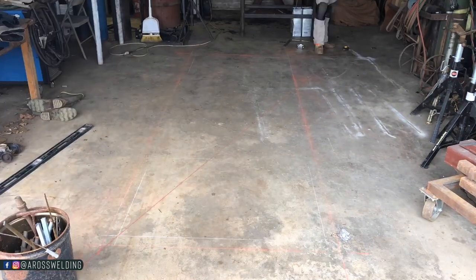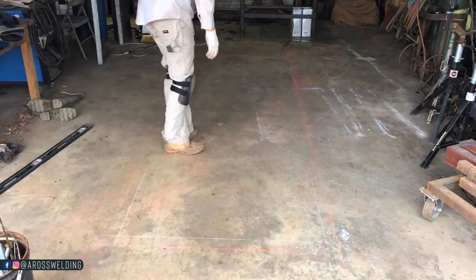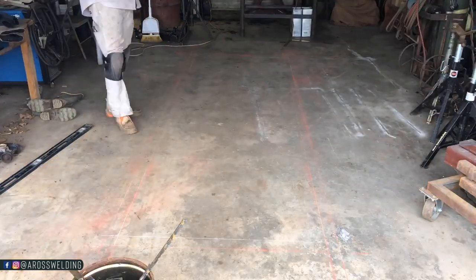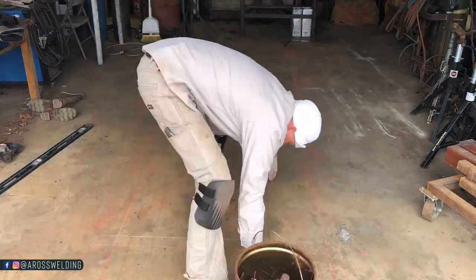He taught me a bunch whenever I worked there, but he taught me to lay things out on the concrete with your chalk line, soapstone, whatever, because you can figure out your angles and stuff by doing this, and it helped a bunch on this project. Arross Welding CAD, baby.